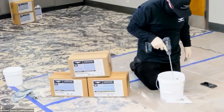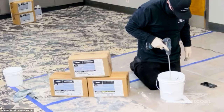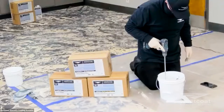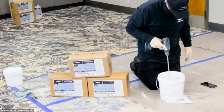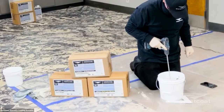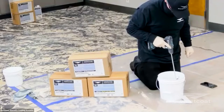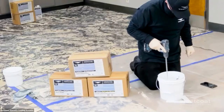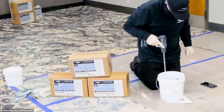Mike is mixing this for three to five minutes, ensuring a nice homogenous mix with a low-RPM drill. You always want to check shelf life — make sure everything is still in shelf life. You're not applying old or expired material, because no one knows if it's going to dry properly or reach all the chemical-resistant properties and physical attributes. Always be sure to check the batch number and shelf life of your products, especially if they've been sitting around the shop or warehouse for some time.